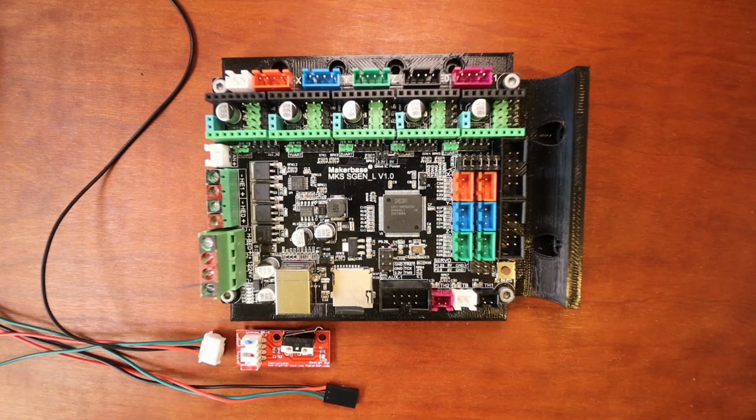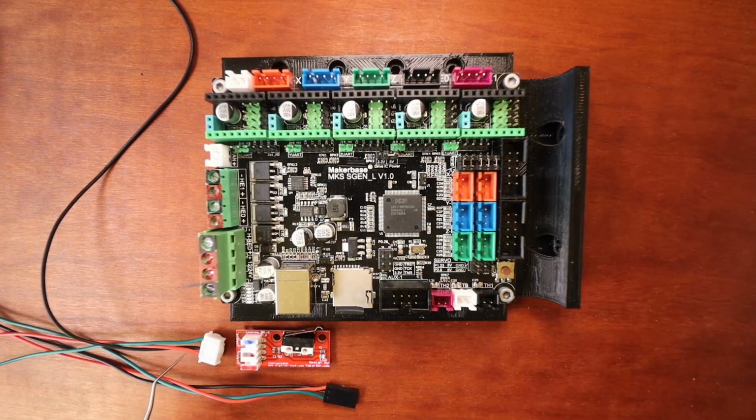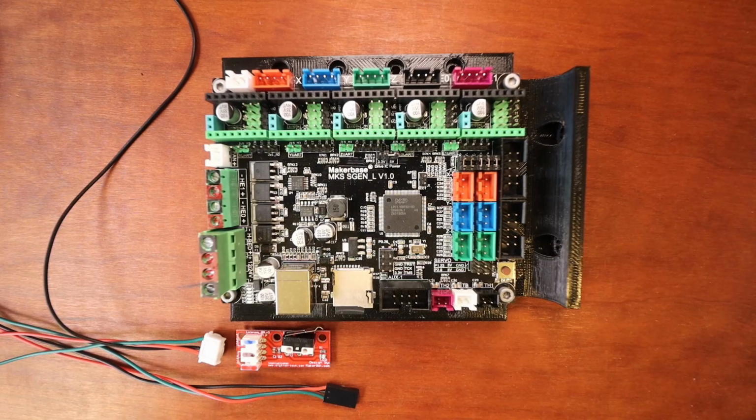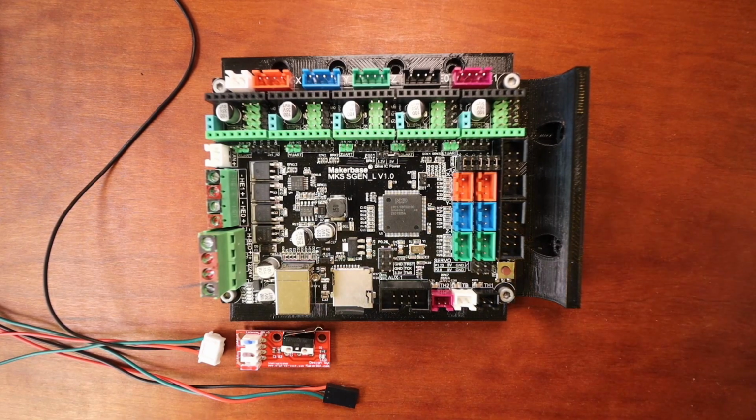So now that we understand that, I have to talk about the switch and what the logic looks like. As you can see right here, on the part that connects to the actual switch, we have the red on the bottom, which is your voltage. The middle is black, which is hard to see on this. And then our green over here is our signal, which I marked as blue for simplicity because I didn't have a Sharpie in that color.